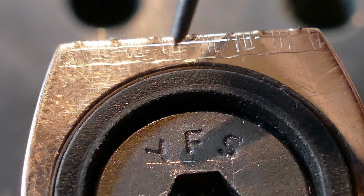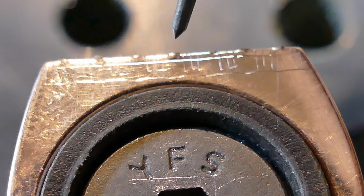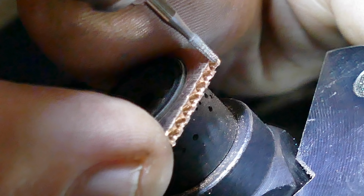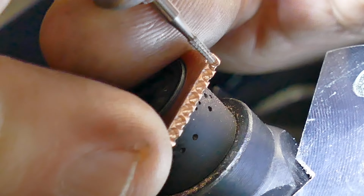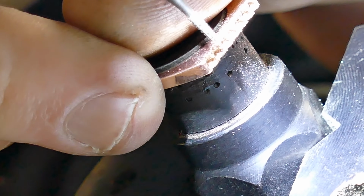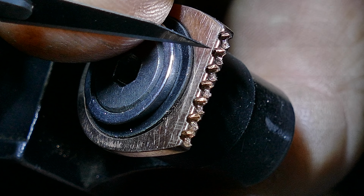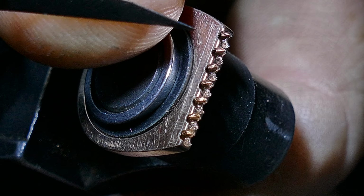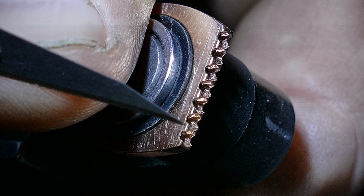So now we're going to start cutting some dips in the side of this with a stick burr. And we're gonna cut it to where the hole touches either side of this line and the bottom one that we drew. So that way the holes are gonna be identical all the way across the entire piece. So now what we need to do is make some lines from the middle of the holes we just created to the middle of the prong on this bottom line and make these little V's that are gonna go all the way down the length of this thing. And that is the outline we're going to use to cut that fishtail French cut all the way down.